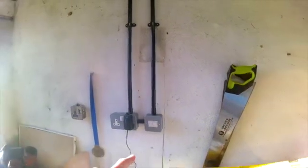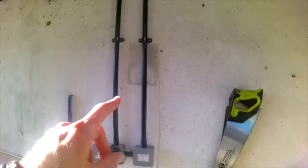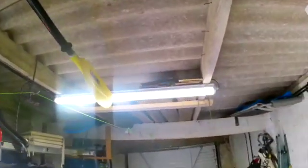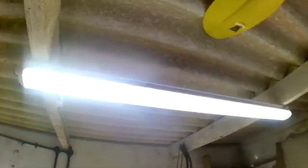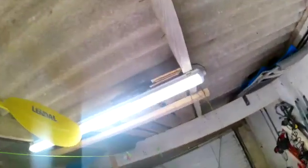I've got another plug socket there, and from that plug socket it goes into another fused spur with a 3 amp fuse on it. From there I've got a 1.5mm cable that runs up to do the lights, which are there - you can't really see because it's quite bright at the moment. I've got three strip lights; they're really easy to install. They've got kind of two push-in cables and they're incredibly bright LED lights - not that expensive.